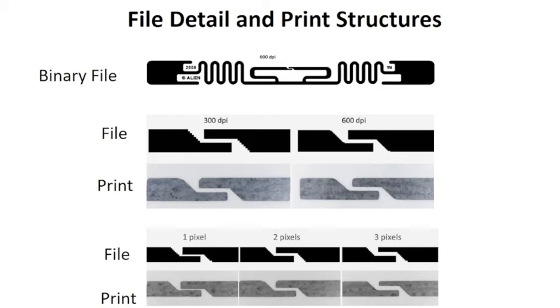You can see the step structure and the very precise dimensions in the file. Because we have thermal activity — we are trying to heat something — the transfer of the heat through the ribbon and into the adhesive is not directly proportional to your file. At the edges, it just doesn't get as hot, so we have rounding off on the corners. All the corners are rounded off. The gap is still good — that's about 170 microns, which is really just right for the typical RFID chip.